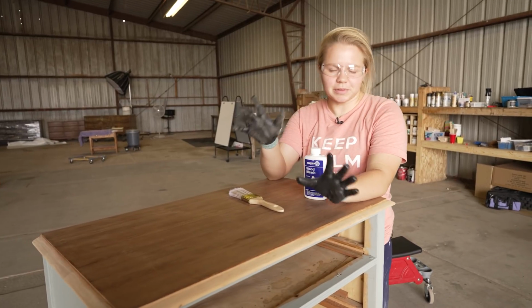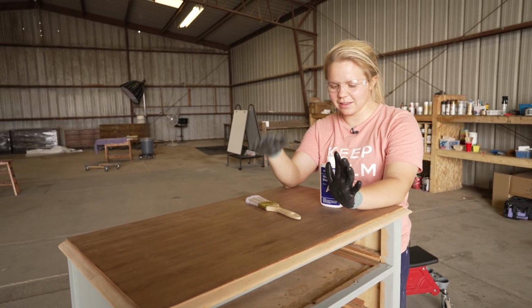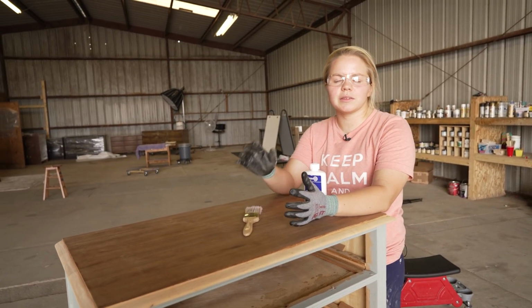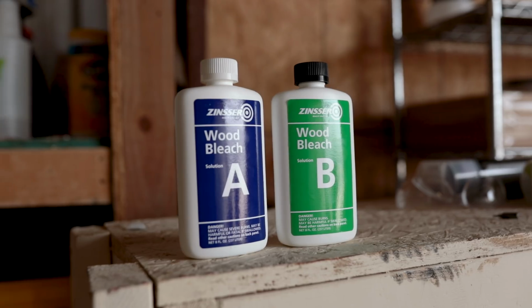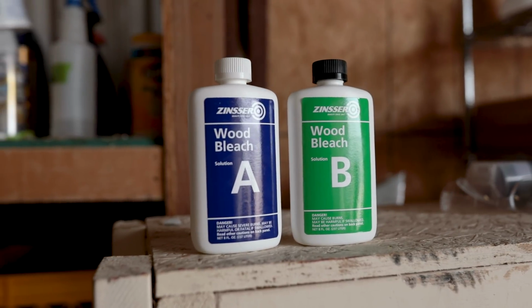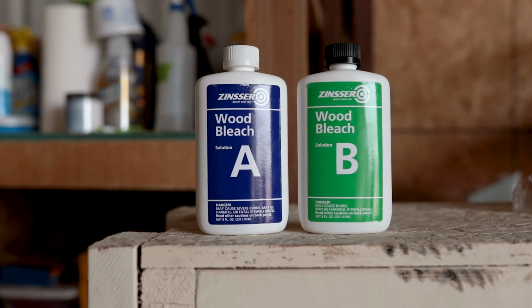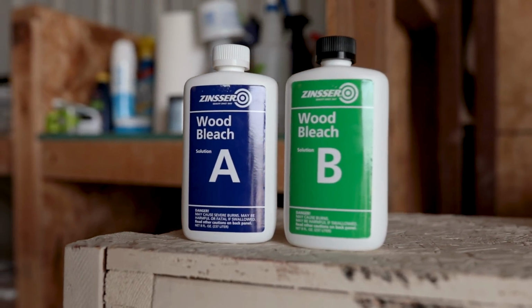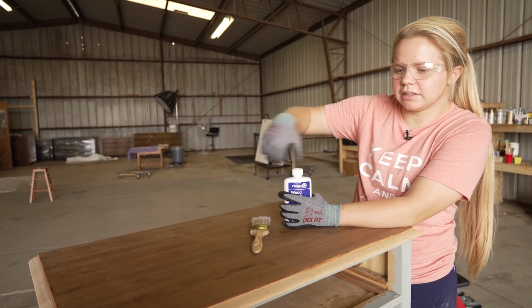Alright, so with the bleach, you wanna be extra cautious. I've got gloves on, I've got eyeglasses on, and then I'm gonna be applying it with a brush. And the bleach solution that I'm going to be using has 2 parts, and we're gonna start with part A, and this is actually by Zinsser. I'll link it down below in the description. You can actually find this on Amazon. I am gonna start with solution A, and I'm gonna put it on my surface.